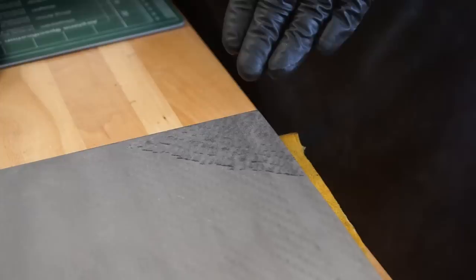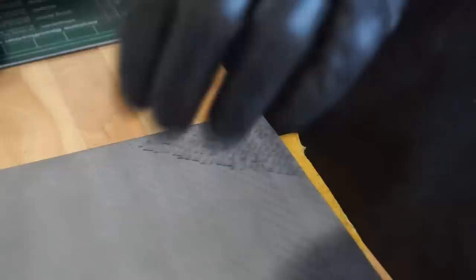You'll notice that I'm pushing up a burr, and you'll notice that I'm actually working near to far. If you work near to far and you overlap, which I'm not doing a very good job of, you can actually cut your previous burr off. So when you get to the end, you basically have very few burrs. Okay. So it's easier to stone the surface. And I'm not going to do this whole plate because I'll be tired and you guys will have fallen asleep on video.